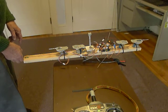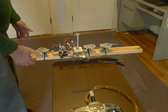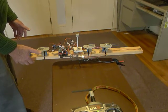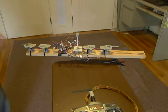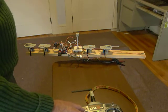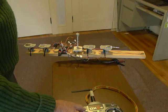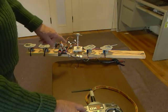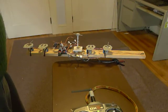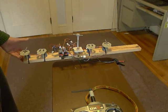So that's how that works. Now let's return to where we were in the beginning. Let's now decide that we're sailing in this heading but we've got a target over here. So what we can do on the radio control is we can turn the director until it goes to a certain position. So now the director's pointing that way, the guns are pointing that way, and so are they. And again it will continue to follow in the same way.